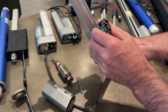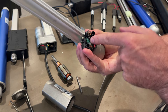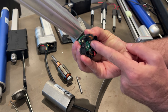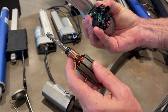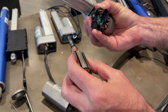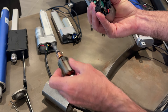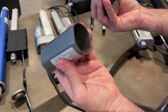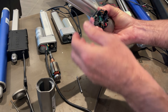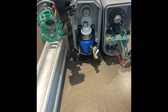You can see four wires here - two hall sensors to measure direction so it can tell which way it's going. That sits right behind the motor. For the motor itself, you can see the two brushes on springs that make contact with the armature. They put power into the windings, which creates a magnetic force that makes it rotate. So there we have three types of feedback: hall sensors, potentiometers, and optical sensors.